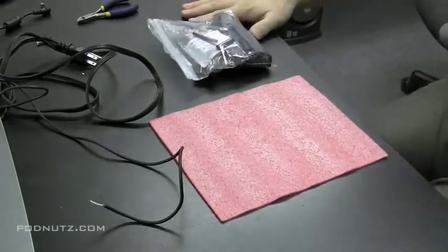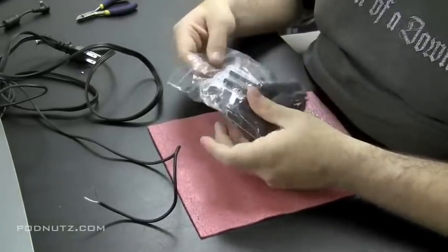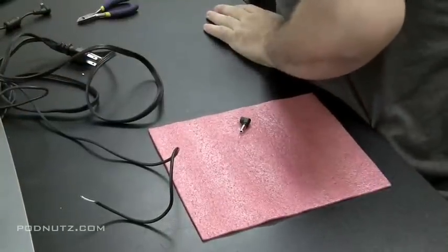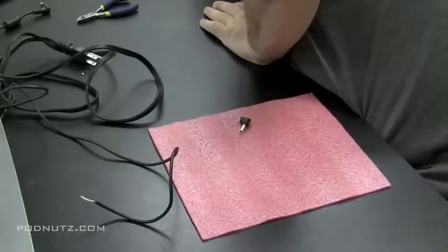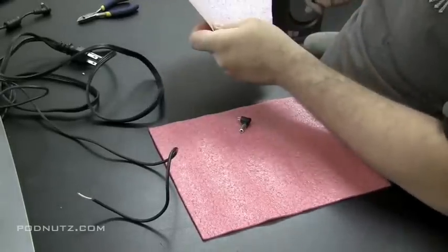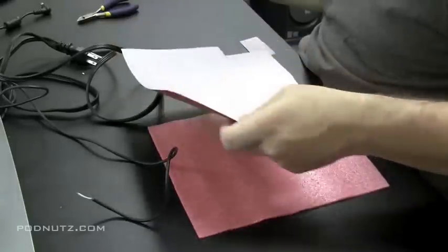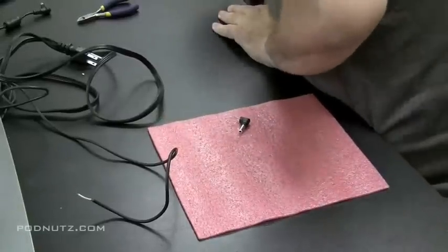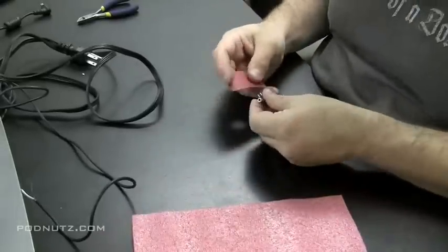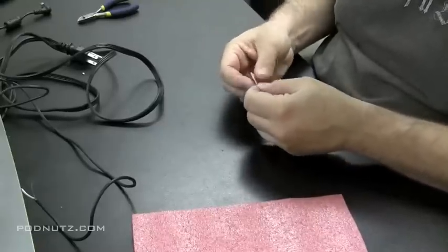You're also going to notice the part coming out of the power brick is frayed as well on this power adapter. So that's going to need to be repaired too. I have another power adapter here up on the bench and I'm testing it, as well as this one. And I'm just going to pick the stronger of the two, which turns out to be the one that doesn't have that frayed part coming out of the brick itself. Just make sure that the voltages and amperages match up on your power adapters when you're mixing and matching them.